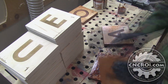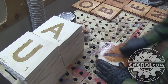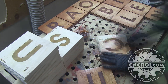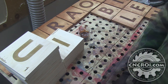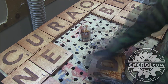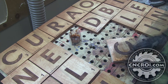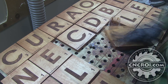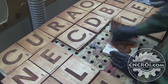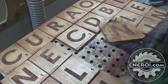Being entirely self-taught, I've realized there's no point drenching the wood with finish or stain, because it creates problems with drying or sealing improperly. Here I'm applying stain to the first tile and spreading the excess onto the next one to distribute the load evenly. I don't bother staining the back side since it goes against the wall, but if you want that done it's just one extra step. Generally I do five sides first and then finish the last side separately at the end.